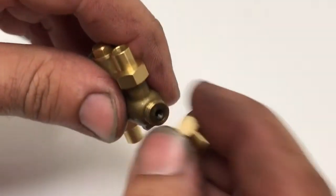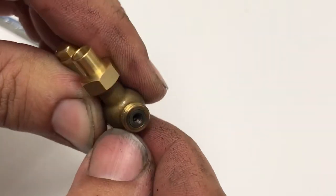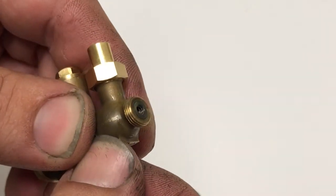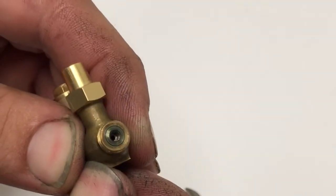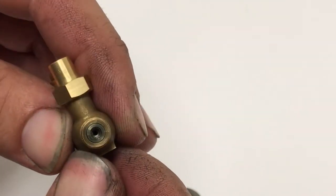Like other injectors, the steam cone comes out with a screw. On this small injector it's only a 4-40 screw. I tried to get something bigger like a 6-32, but there's just not a lot of room. It comes out just fine with the 4-40.